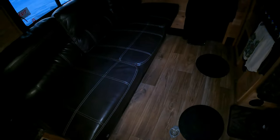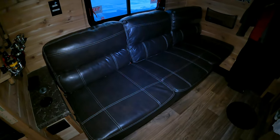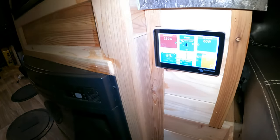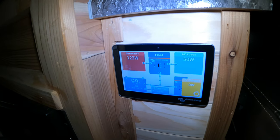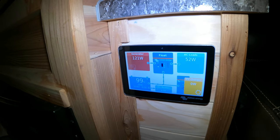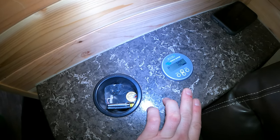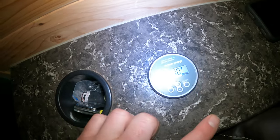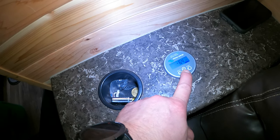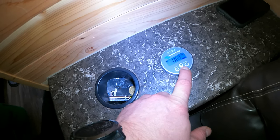The main thing I wanted to know was how much room was under this and what you could fit — but I ended up packing 10 pounds of junk in a 5-pound pail, basically. So I'll just walk through. I've got this Victron display screen hooked up to a Cerbo GX. This is a Victron BMV 712 smart shunt — the first monitor I set up in here. It tracks all the battery usage, voltage, how many amps are going in and out, battery percentages, how long it'll go, battery temperature, a lot of stuff like that.